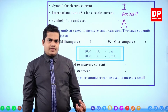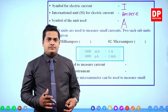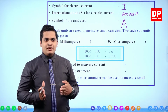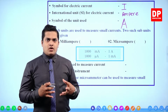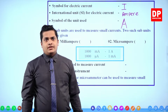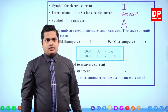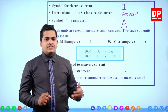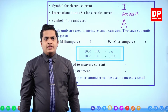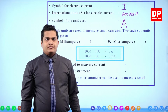If you connect a dry cell to an ammeter, the indicator will move only slightly. We can't get a very clear value. If the indicator showed up to 5 or 2-3 amperes, then we could measure. Actually, in a dry cell the current is less than 1 ampere. The maximum would be 1 ampere. So we mostly use the milliampere. When we complete this table, I'll mention the relationship between ampere and milliampere. But up to now, just keep in mind that we can't measure small currents by using the unit called ampere.